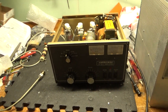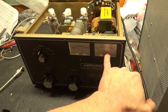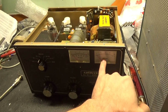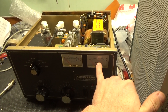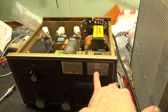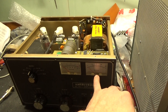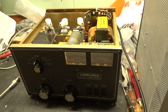So where do we start? First off, the LED was out on this meter. It had two LEDs in series. This meter worked with the LEDs, this one did not. He told me something about the guy stating it was modified to light up with modulation, which didn't make sense — they're both in parallel. I took it apart; one LED's out. So I ordered new LEDs, I'm waiting on those. I'm also waiting on a new dropping resistor for the board.